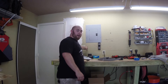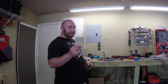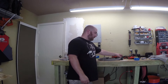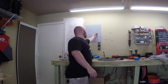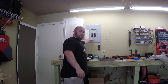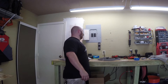What we're actually going to do is put a plug right here, but for now I'm simply going to use a block-off plate because I'm not really sure what type of plug I need yet — it depends on what brand welder you buy. Some of them are four prong, some are three prong. Inside we're going to be installing a 40 amp breaker. On a standard house panel each of these slots is about 20 amps, so a 40 amp breaker is going to take up both slots, and that still leaves me two more 20 amp breakers I can put in there.